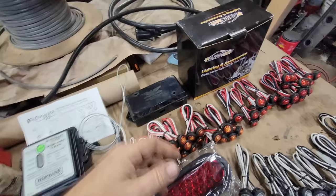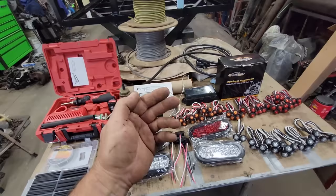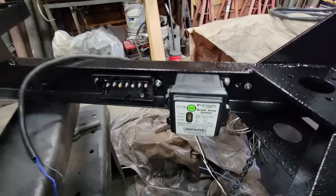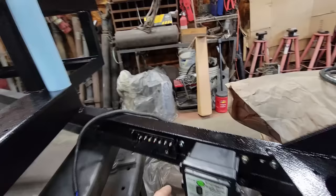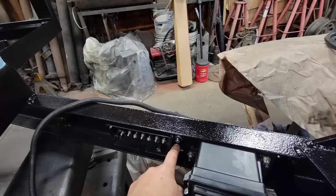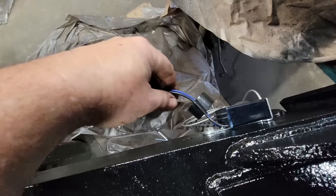For additional wire, because I take apart so many medium-duty trucks that are 35 feet long, I keep the wiring that comes with them. A lot of times I use that to wire trailers because you can't beat the quality of OE manufacturer wiring harnesses. We have the breakaway box mounted as well as the junction box. I like to use nylock nuts anywhere I can when plastic is involved — the nylock uses a nylon insert to keep it from backing off. A lock washer needs tension to do that; a nylock doesn't. This also helps keep from blowing out and cracking the plastic.